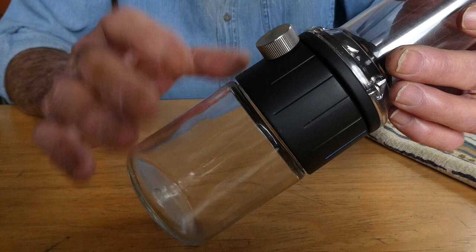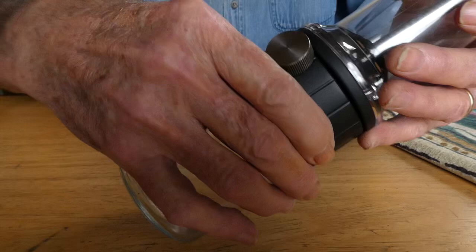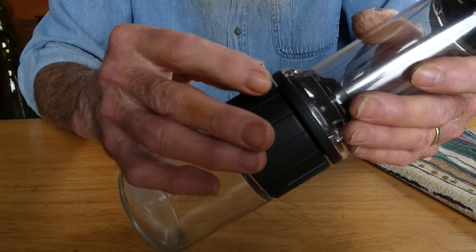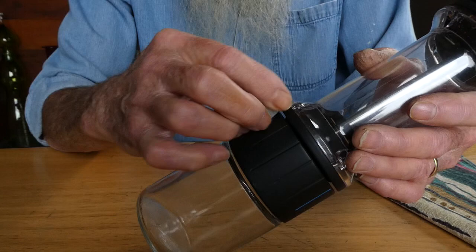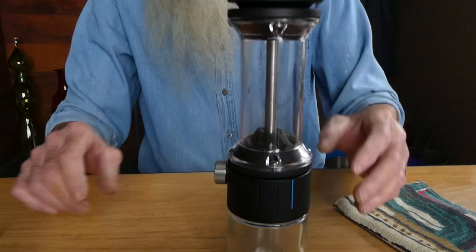Let me talk about this knob. You need to dial in the feeling for how tight to set it. When it's loose, it's completely free. Just go up and get a feeling for how tight you need to make it. It's locked — but I can move it a little bit. A little tighter — that's it, completely solid and locked. Not over-tightened. Over-tightening will reduce the life of the nylon tip; it'll cause the nylon tip to squish. It might also make marks on the carrier. Find out how tight it needs to be — it's very sensitive and doesn't take much.